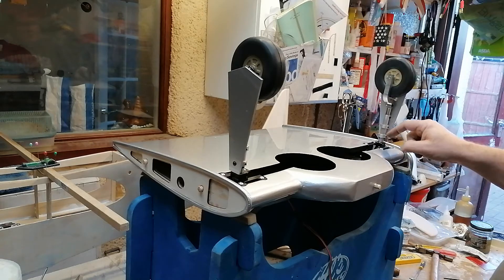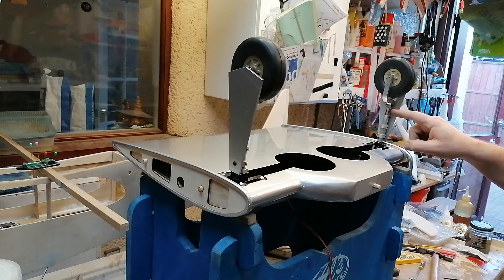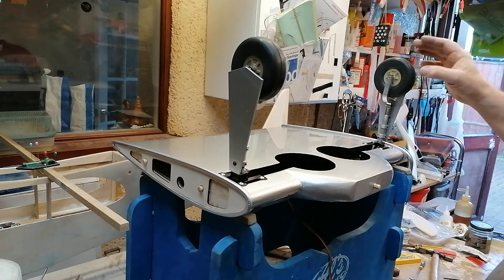A bit on the weak side. Everything's face to face. Corner radius is on everything for strength — even on there. Never have a sharp corner in anything when it's pegged into a hole, otherwise that's a shear point. If you have a heavy landing, it'll just bend if anything, but it won't shear off.